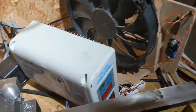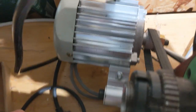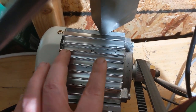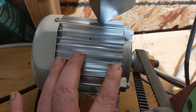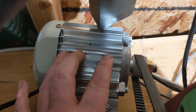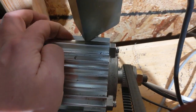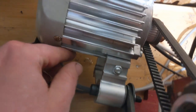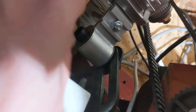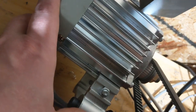And for the other one that I just bought, I'm a little bit worried about the amount of surface area there is. Now the motor is also going to get hot, and so what they've done with this Consew version is a couple interesting things. The first thing is the motor case is a heatsink. So this gets the heat out of the motor, which is good for the life of the motor. But they've also integrated into that heatsink these mounting brackets, and so this bracket here can slide back and forth or be repositioned. I've kind of got it hacked on here just to the banjo of the lathe. This works well enough for what I'm doing.